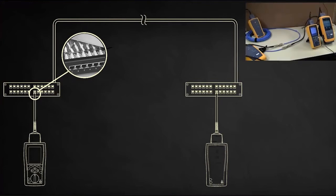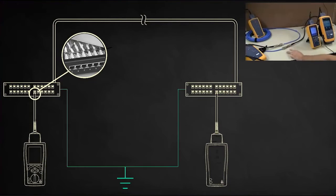However, in a data center this jack is going to be in a rack, and in the rack they are going to be grounded. Typically the two racks are going to be grounded to the building, so electrically speaking this jack is going to be directly connected to this jack here.